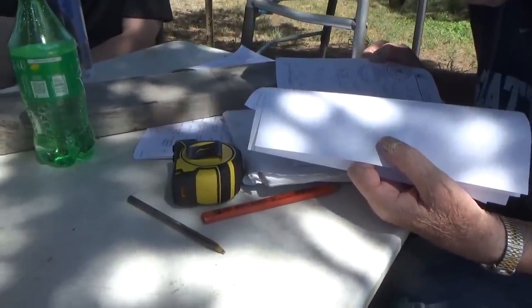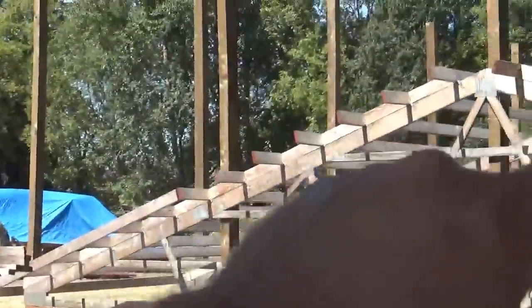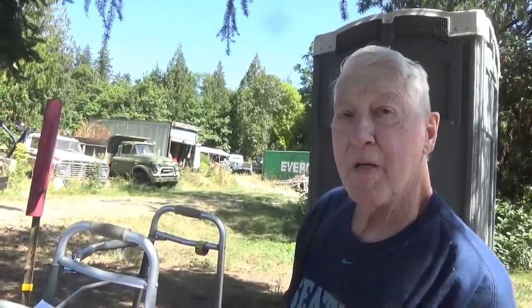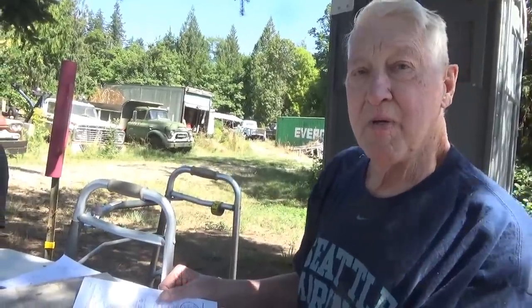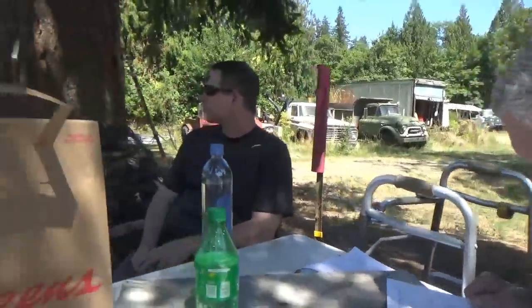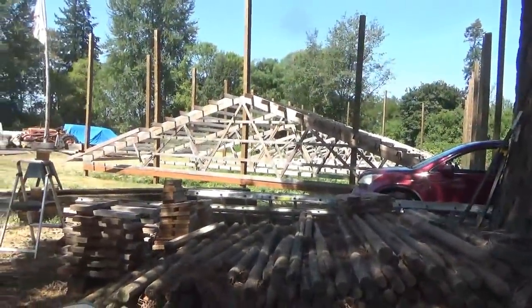Lou, a question I've been getting from a lot of my viewers. They say that my trusses aren't designed to have the OSB on top and that it'll be too much weight. What do you think? They say that putting the OSB sheets on top of the roof will be too much for it. No. I don't think so either. What is the weight of the insulation? I don't know, probably per square foot. What's the weight of the board per square foot? Negligible. You're not talking pounds. You're talking probably half a pound, maybe a pound per square foot difference. It's going to add strength to the structure. Sheet insulation. And your loading is 25 pounds dead load. Okay. I think we'll be fine, don't you? That's what I wanted to check.